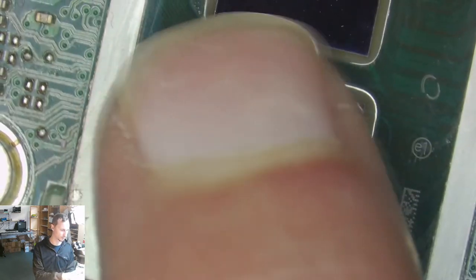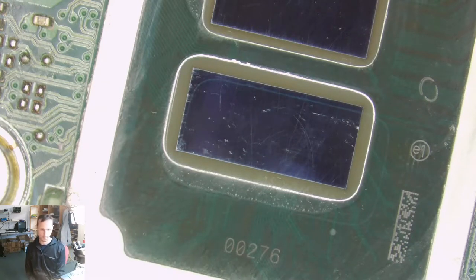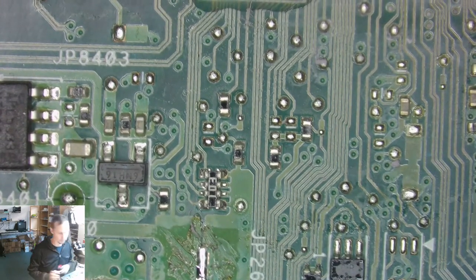Well, you have a shorted CPU. If you have the right tools, you can try to desolder it and reball it if it is okay, and just shorted pins. But I think that's an internal short and everything is not nice. We can have some measurements. What I'm interested in, how much voltage did this thing get here? Well, we can measure that.